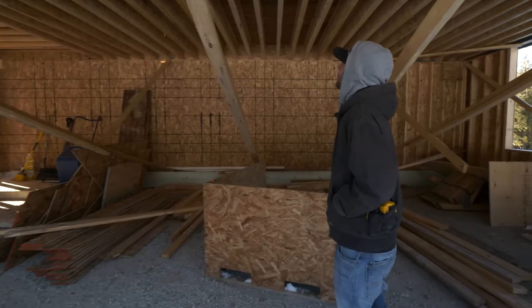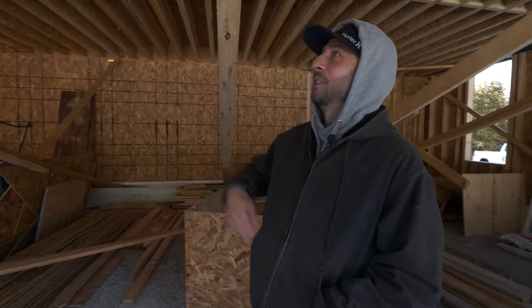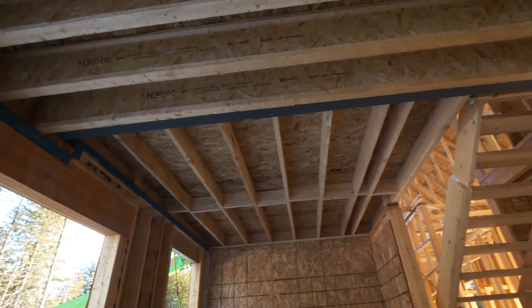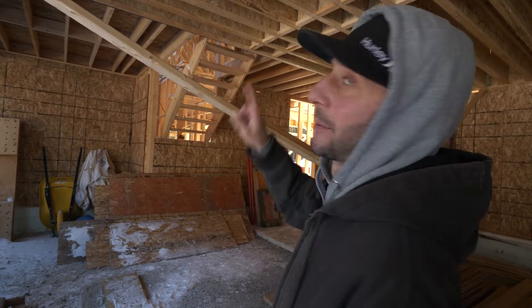We started over here in the garage. We're going to have a floor package over here. We also had to do some hand framing with two-by-eight lumber. You'll notice we had to switch heights to make them all line up at the top. This also allows us to do an insulation detail for any kind of heating we might have to do in the garage for the upstairs floor.